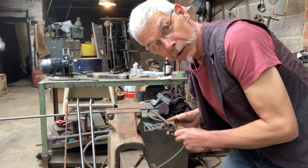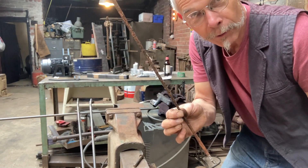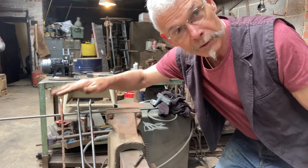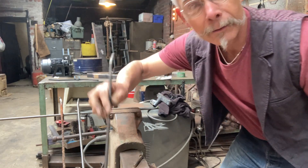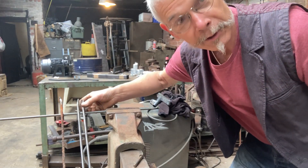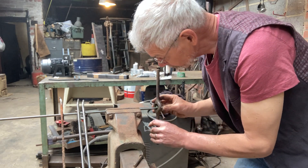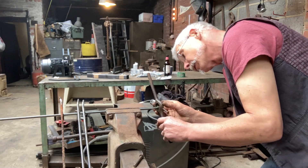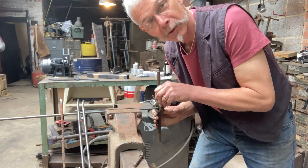After a lot of deliberation, it was decided to remove the totally rusted-out support bars and manufacture new ones. It's original steel rod, and the thread on the end — the nearest I could find — is 5/16 British Standard Whitworth, Imperial size, so we're pretty close there. I'm just about to cut another one on here, which it's been a few years since I've done this.